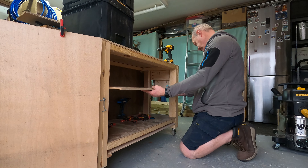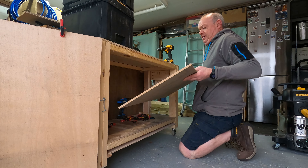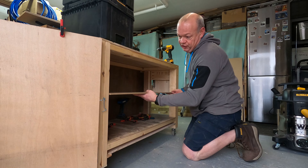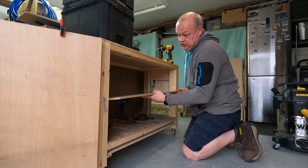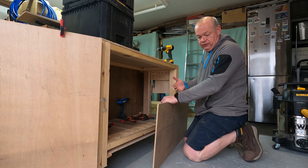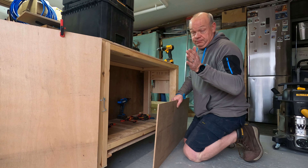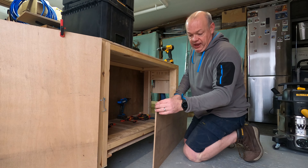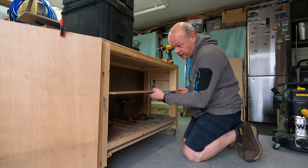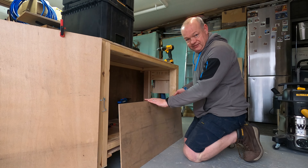It fits at the front and it fits at the back, but it is a bit tighter at the front than the back. It's a lot looser on this side, which potentially means I need to trim a little bit off the edge. I might just run it through the table saw on the tightest setting — put a sacrificial fence on and literally just take the kerf width of the blade off. Bearing in mind it will probably swell a little bit, it is literally about a millimetre too tight at the front.